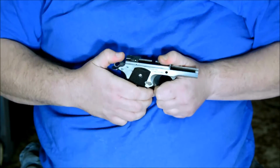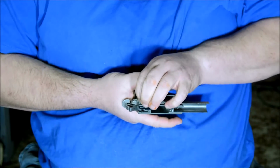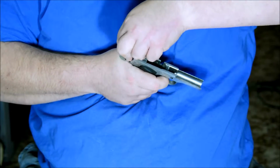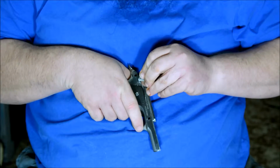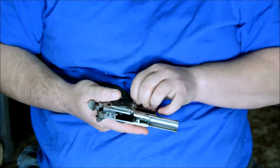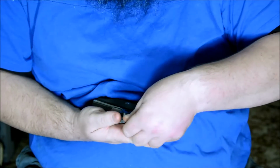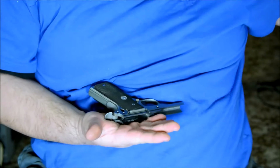From here, we cock the firearm. Applying the safety catch and pulling up on it and wiggling it, you will actually pull the safety catch out. Decock the firearm. Using the post on the safety catch, we push the hammer pin out. When we remove the safety catch now, the hammer will come out, and so will the safety catch, unique to the Series 80s pistol.